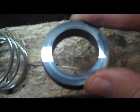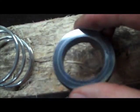Typically a seal is going to have four components. A round piece like this is either going to have an O-ring or it is going to be in a rubber cup. This one is an O-ring. This is called the stationary seat. You will notice one side is shiny, one side is not shiny. The shiny side goes up away from the motor. There is a spring, a centering washer, and what is going to be called the rotating head of the seal. This is the part with the graphite. This part goes on the shaft sleeve. The stationary seat goes in the motor bracket that we just looked at.